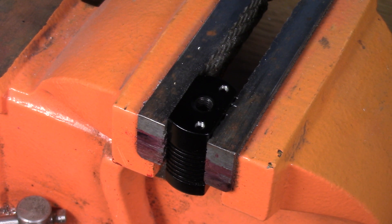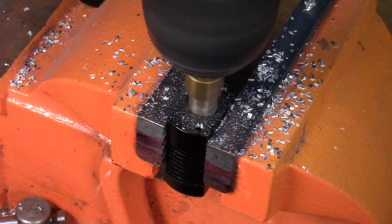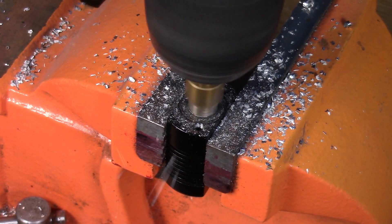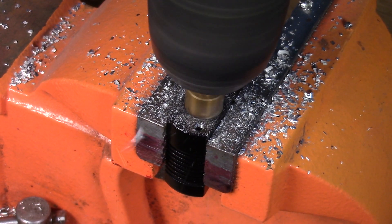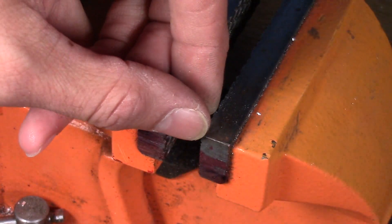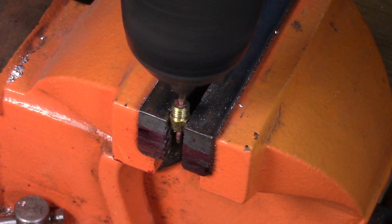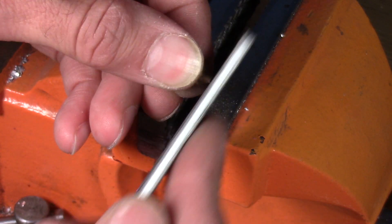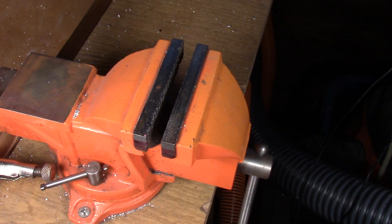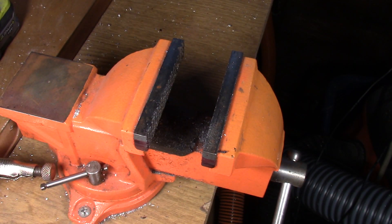Drill out the center using the 3/16 to 1/2 six-step bit, drilling through the center core until you've hit the half mark on the drill bit. You will be able to just round the top with the last step in the bit — avoid going any lower as you can blow out the holes for the shroud. Sand lightly if needed, unclamp, and put to the side. Set the nozzle into the vice clamp with the tip downwards. With the drill on low torque using the 1/16 drill bit, drill downwards into the nozzle to form a 1.6mm hole. Sand the tip lightly if needed. Set the bottle cutter into the vice clamp with the 3/16 drill bit and drill the bottle cutter's holes to accommodate the three screws and nuts reclaimed from the gantry's right side. Attach the bottle cutter to the cutter plate — Recreator Part 1 cutter plate — using the three screws and nuts saved from the previous step.